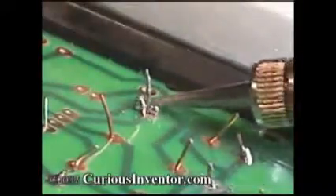Also, although you can't see it, a layer of oxidation — basically rust — is covering the parts, solder, and iron tip, and it's preventing the solder from wetting or sticking to anything.